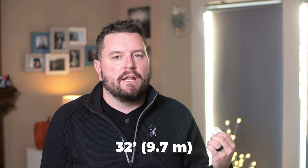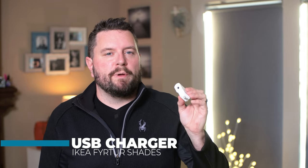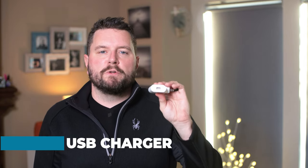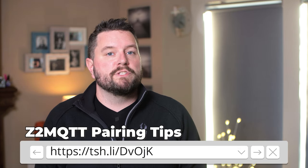One of the coolest things included in the kit is a USB-powered Zigbee repeater. IKEA says you need to have one of these installed within about 32 feet of the shade in order to keep the communication strong. I have one in front of each shade group and scattered around the house. Also included is an AC to USB adapter for the repeaters, plus the repeaters have a female USB port on them that you can use with the same plug to charge the battery — very clever. If you're not using the IKEA hub you can still use the repeaters; they work very well with my Zigbee2MQTT network and have really increased the reliability.